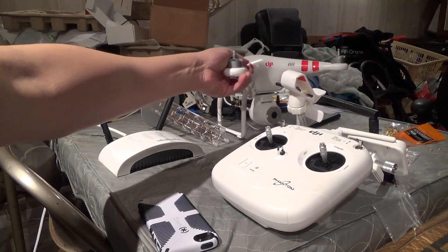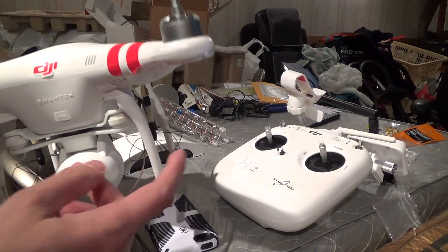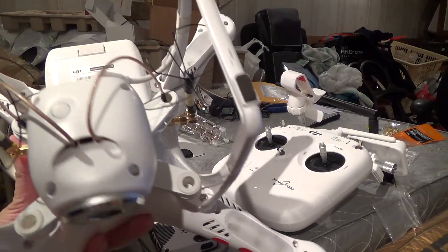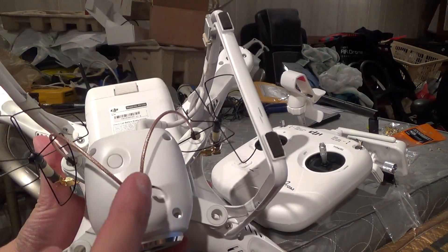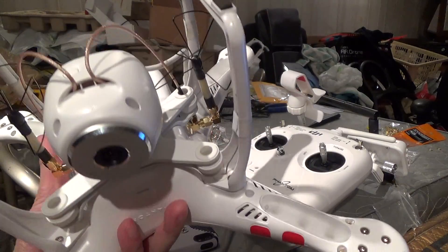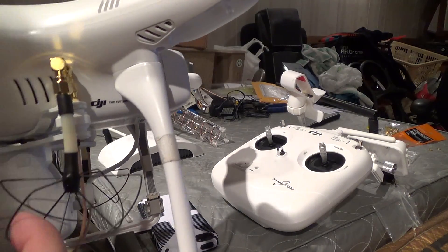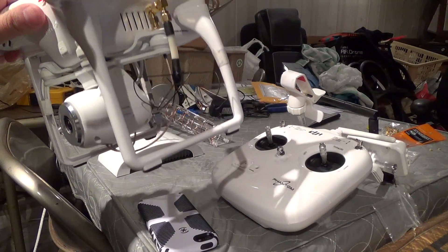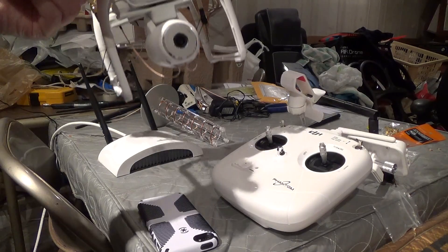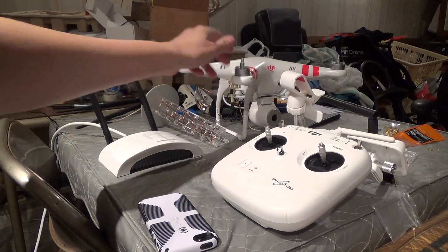Also, as you can see with my Phantom, I redid my antenna camera mod. I also used a thicker gauge cable wire — this is RG178 — and these are skew planar antennas, which will give more reliable FPV than a regular linear antenna.